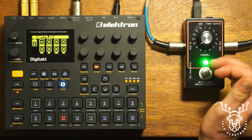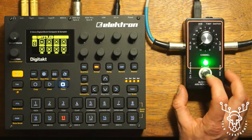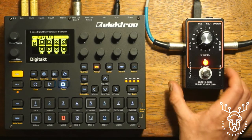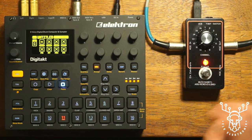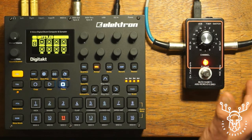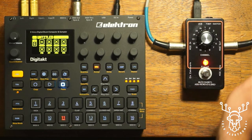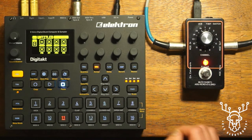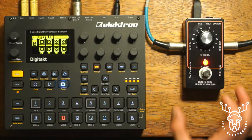When the LED is green it's going to pass everything from the MIDI in to the MIDI out. When you press a short press on the switch it will change to red, and we're going to mute the channels that are in the mute group. Channel 11 is not in the mute group, so channel 11 will pass whether or not it's green or red. But everything else in this example is in the mute group.